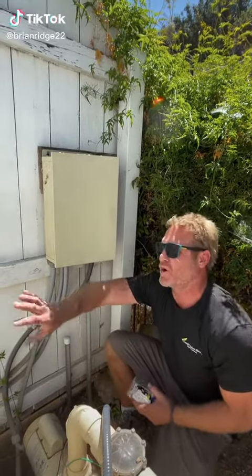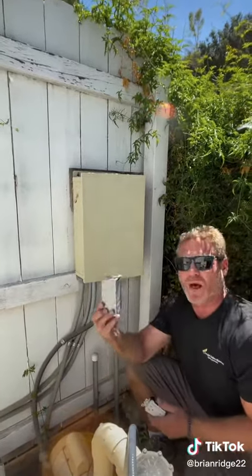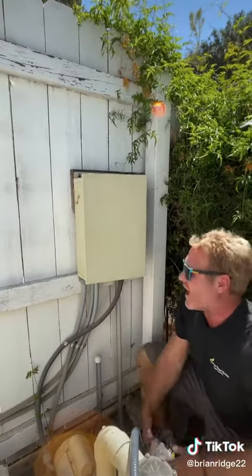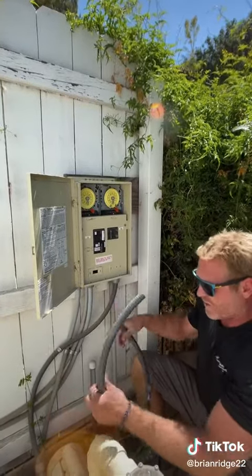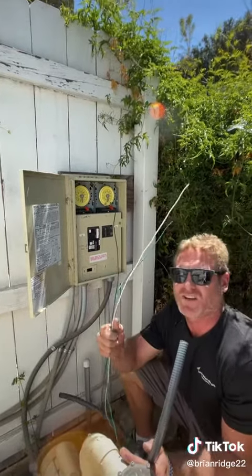This customer wants to add an outlet outside because he's putting a sprinkler timer where his pool equipment is. So I'm going to install a bell box to the wall with a GFI outlet and an outdoor weatherproof cover. I'm going to install a new breaker in the panel after I run seal tight conduit from the panel to the new location with number 12 wire because it's a 20 amp circuit.